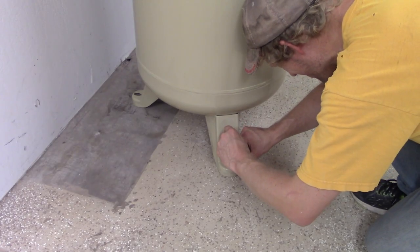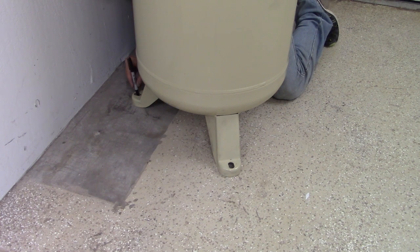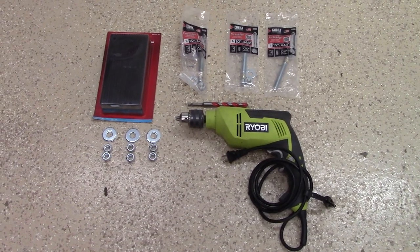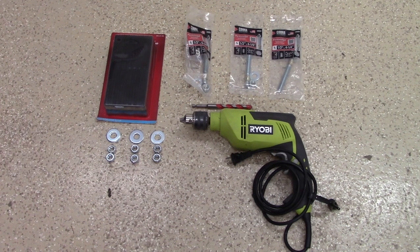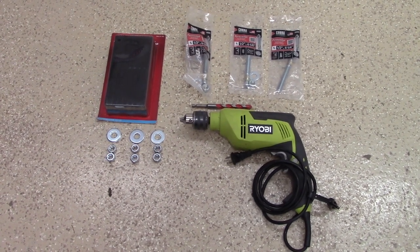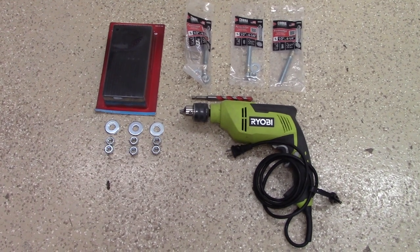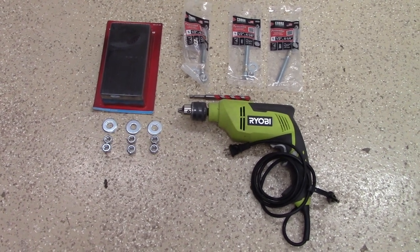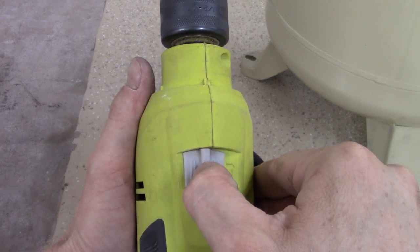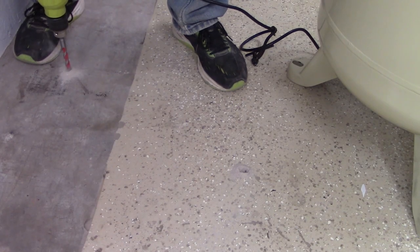I used a Sharpie to mark where I want to install my concrete anchors, and then it's time to get those concrete anchors installed. There are a few different items I used — one was a compressor insulation kit, these rubber pads. I'll link those in the description, as well as the concrete anchors I used, which were half-inch by four-and-a-quarter inches, and that worked for my application. Look at your own application to determine what's best for you. The RYOBI drill I use has a hammer drill setting, which I set to for this job — it certainly makes it easier. Then I proceeded to drill through the concrete for each of those holes.